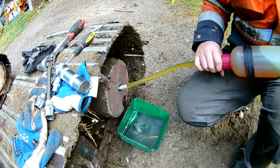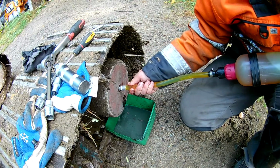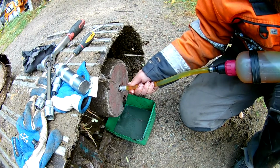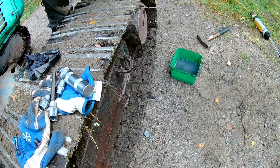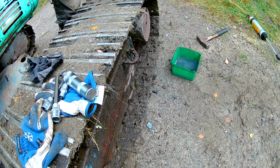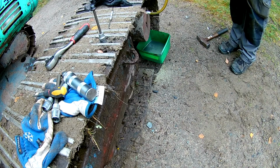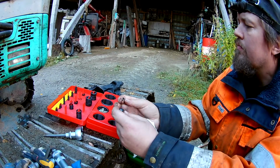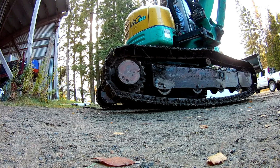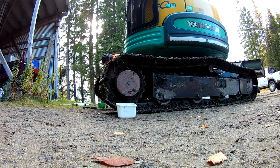with the oil drained, I had to remove the upper plug to help it drain faster. I think that was not done last time, and then we had more time around, so we just let it slowly fill up. But I was more in a rush now, so I figured I would just fill from the top. That did not really work, because filling from the top, it kind of pushed oil out. There is some stuff just inside the plug, so I moved things around so I could fill from the other hole and have that above the middle as fill level. One o-ring on the plug was damaged, so I replaced that and moved to the other side.